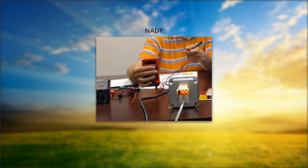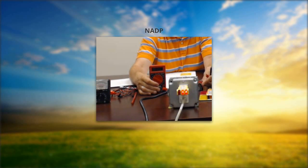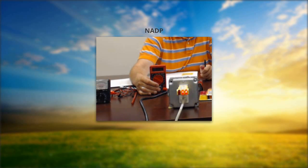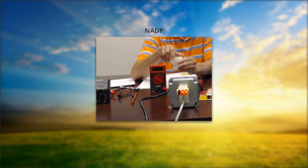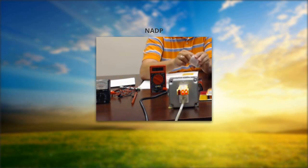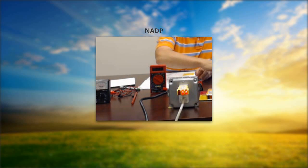I'm going to move on and talk about testing fuses — on page 8 of your handout, which covers resistance and conductivity. We're using resistance and conductivity to test the operation of our circuit. Some meters have an alarm built in so you can tell whether fuses are good — this one doesn't, so we'll have to use the reading. I have some cartridge fuses here that we use in our collector. One imperative point: please don't trust the function of a fuse by eyesight alone — they can look good and still be bad.